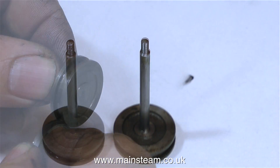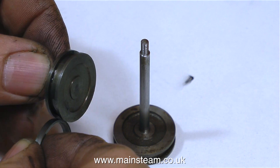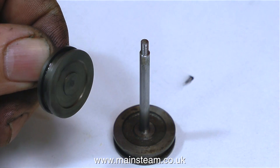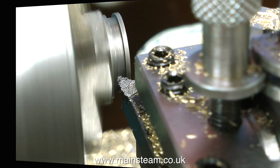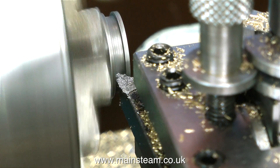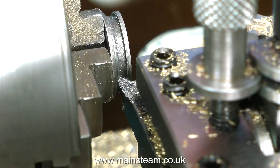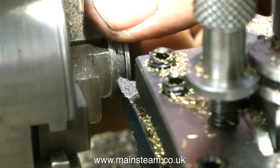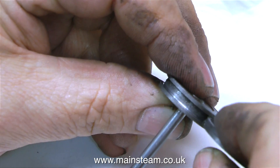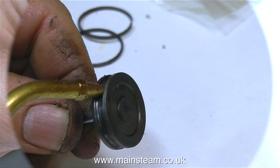Now I'm going to have a look at the pistons. These pistons appear to be quite well made, but the problem is that the piston rings supplied with the engine don't fit in the grooves — well they do, but they're too tight, and you cannot have piston rings in a groove that are really tight. To fix this, I put the pistons one at a time in my small Boxford lathe, and using a very sharp carbide tip tool, I removed a very tiny amount from the inside edge of the groove. Returning to the bench, when I try the piston rings in the pistons now, they fit perfectly — there's no shake, and there's just about enough friction to hold them in place.